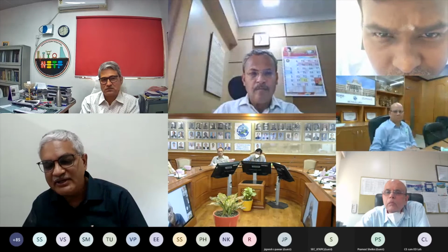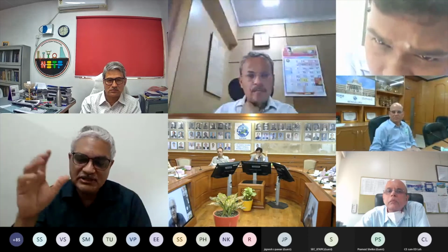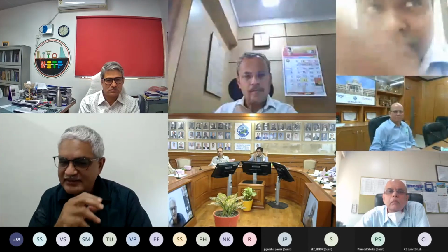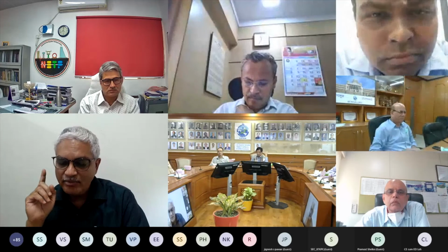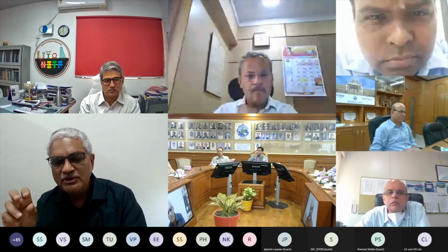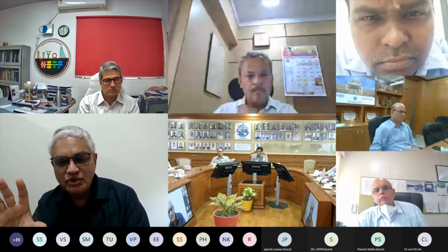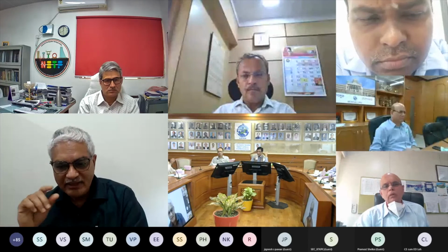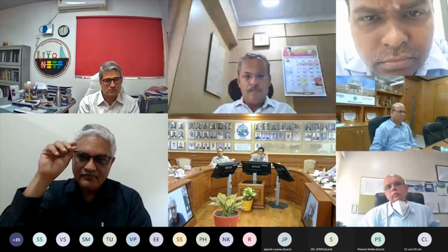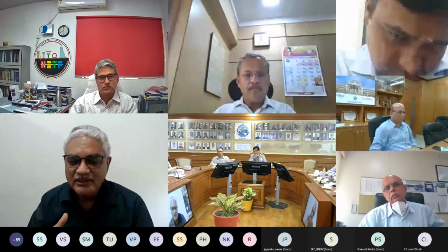CBRI had done in the 70s, and later on in a collaborative project, we had used those precast components and done a single story construction at CBRI, tested for lateral actions. But I would think that the number of tests is too few for us to make a clean recommendation today itself. There are some obvious no's that we have learned from that, but the exact design of the joints is yet to be confirmed there.